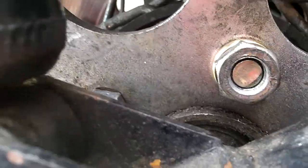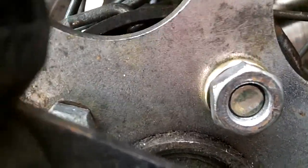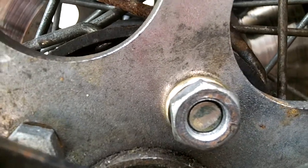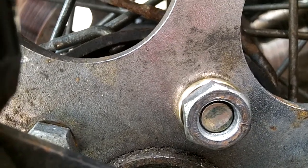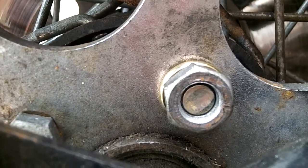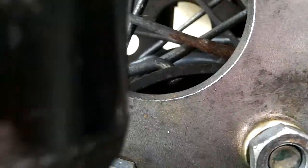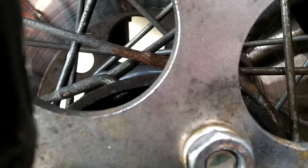You can see what you've got. Now, there was no Loctite on any of this. The lock washers were insufficient with the vibration. So I'm going back with blue Loctite. Don't put red on it — you'll never get it apart unless you heat it up with a torch. But the blue will work. A fresh lock washer is definitely going to make a difference.